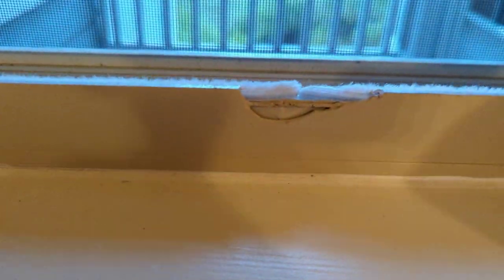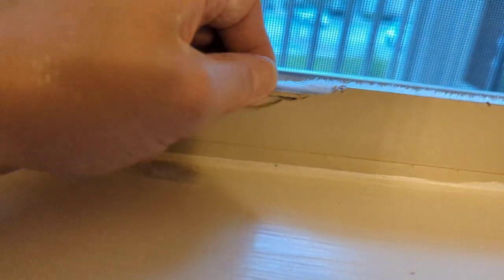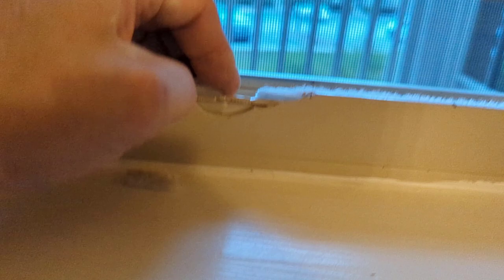Okay, I got my pliers. Try to straighten this out the best I can. A little piece of the trim or the seal broke off. Not too big of a deal. Might be able to squeeze it back in there, we'll see. But I got a piece of tin here cut. Plan is to get this inside here, close the window, and I might be able to sneak that back in there, and then we'll try to form out that the best we can with our putty here. So let me see if I can get this in here and get the window closed. All right,